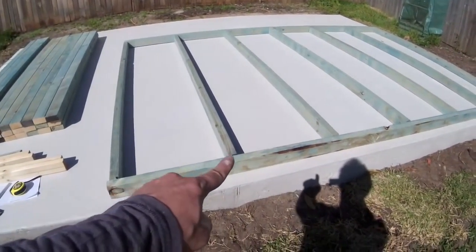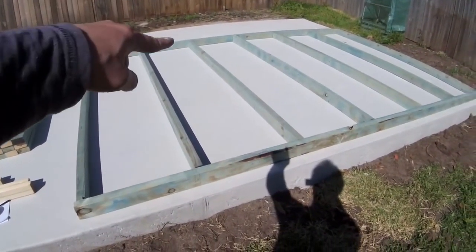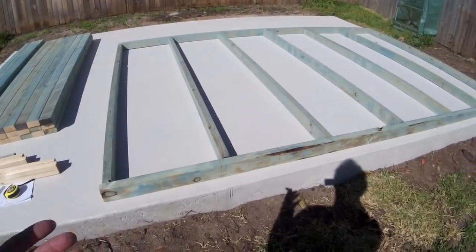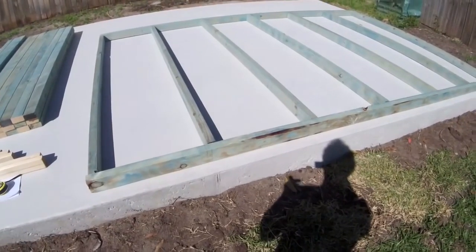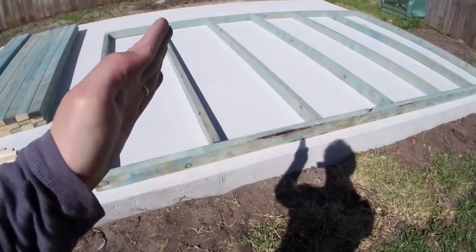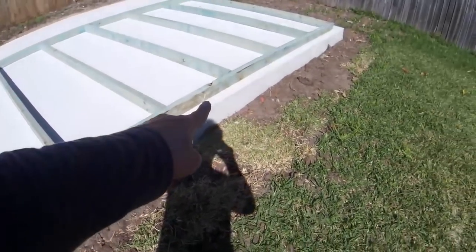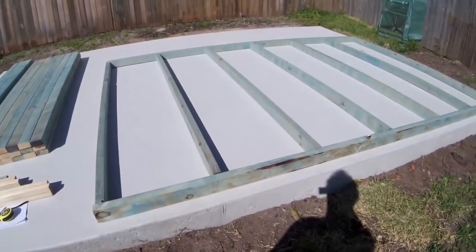I'll be nailing the bottom parts and then screwing all the in-between bits that keep it steady. I was informed that nailing is better than screwing, because nails can bend, so they will cope with any friction. But screws will break when you bend them. So it's better to put nails in all the bottoms, but use screws for the rest of it, because they'll be fine.